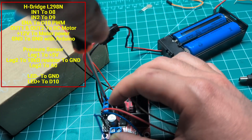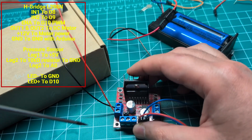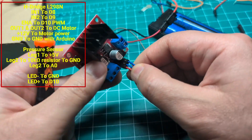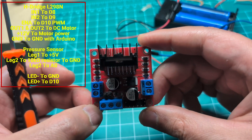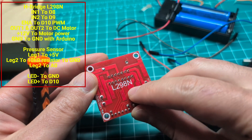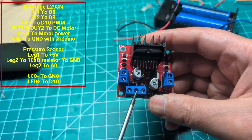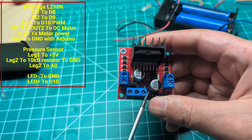Here is my DC motor with two output terminals on the H-bridge. I have a separate video explaining the L298 on its own, which I'll link in the description. This is the L298 motor controller — to connect power, the middle terminal is ground. If you have 5 volts you connect it to the 5V input; if you have anything over 5V like 12 volts, you connect it to the 12V input.